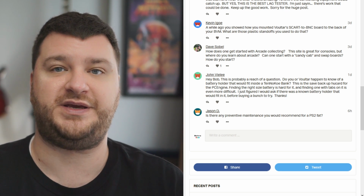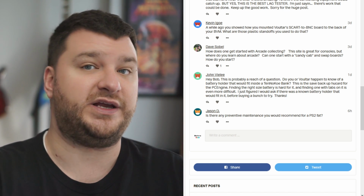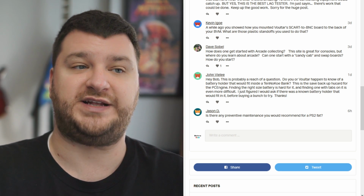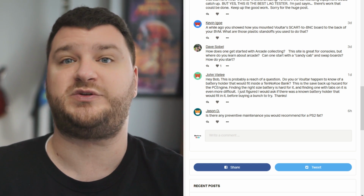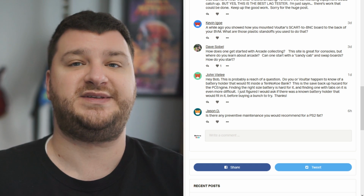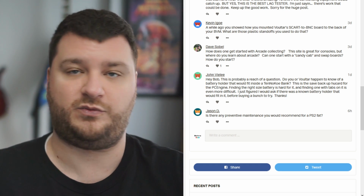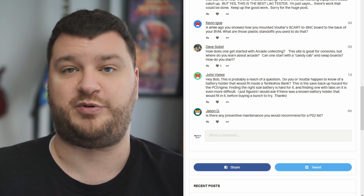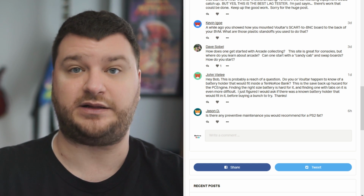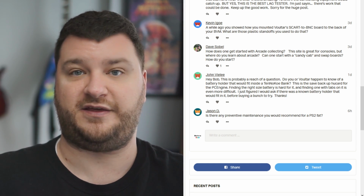There's certain model PS2 FATs where if you do the C-Sync mod to it, everything else still works. So that's the one hesitation: with many models, and I would say most models of PS2, if you do the C-Sync mod on it, you obviously would lose composite video, whatever, but you also lose component video. So for me personally, I don't care. That's exactly what I want. I just want RGBS out with all resolutions, nothing else.